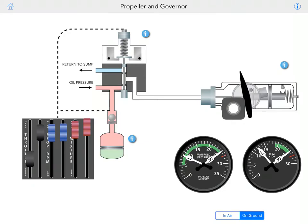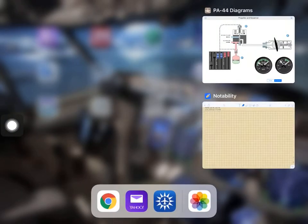All right, so now we call this a constant speed propeller. What does that mean? Constant speed, constant RPM. It's very basic. Just remember these flyweights and the disc, which I said spins really fast, and the pilot valve is connected to that disc, and the pilot valve is connected to either the camshaft or crankshaft.